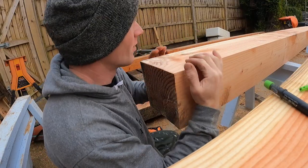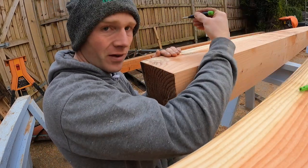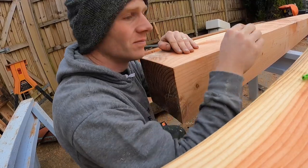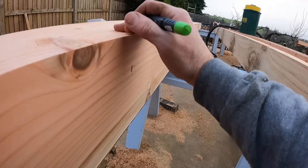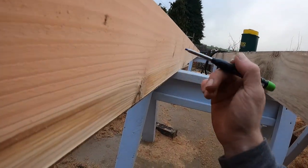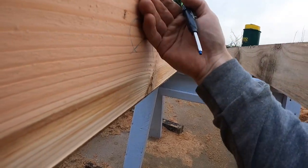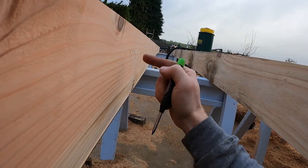There's a bigger crown that way, so I'm going to stick with what I had — this will become our face for outward cladding. I shouldn't have drawn anything on it. So that is the crown, which will become the top of the beam. This relatively straight edge will become the face — we'll reference everything off this outside face. As far as timber framing goes, that's a pretty straight beam.